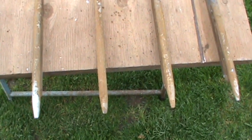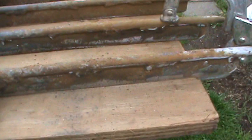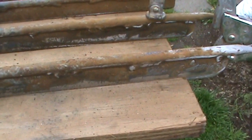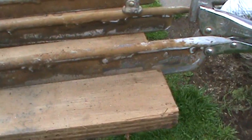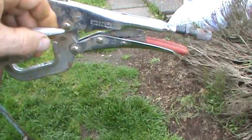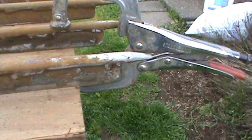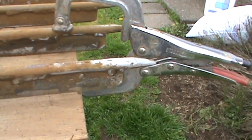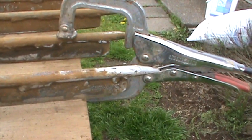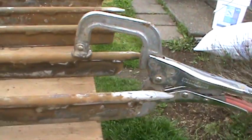This is just mild steel, so to make it strong you have to put a gusset in. I made it out of quarter-inch by one-inch by 16-inch long flat stock — you can also use eighth-inch by one-inch by 16-inch. Each one of these gussets is 16 inches long, welded to the half-inch stock all along. I left the tip right there and it's just 16 inches, going all along the whole thing. So you need four feet of those. You need three four-footers of the half-inch round stock and three four-footers of the quarter-inch by one-inch flat stock. That'll do it for you.